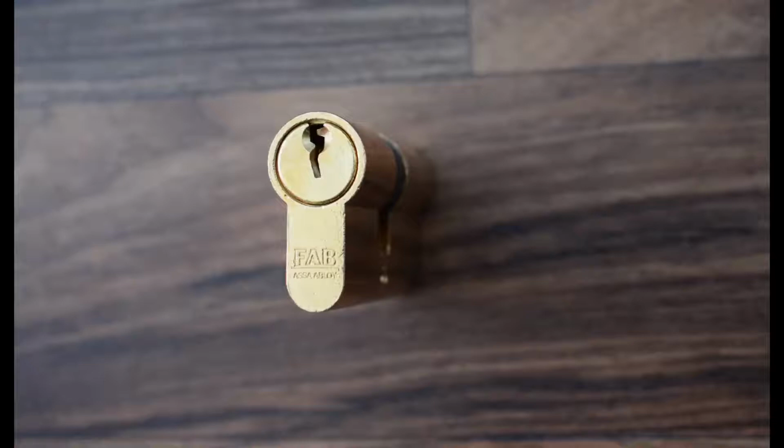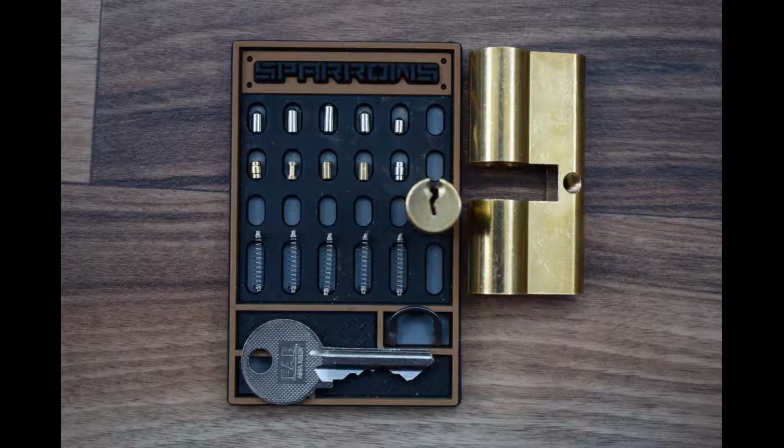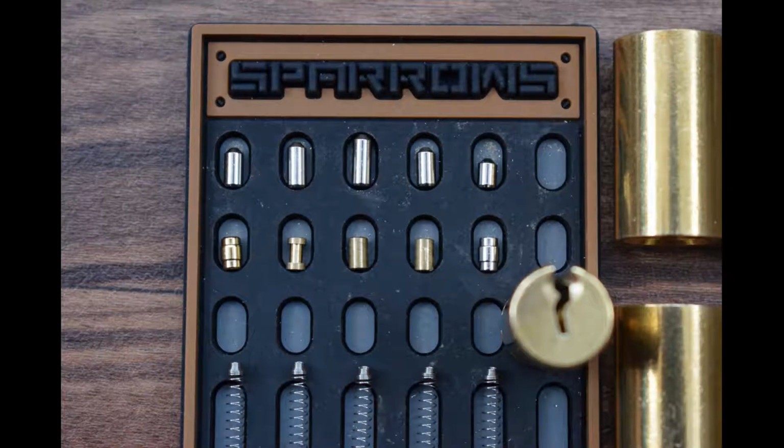This is FAB 100D. It's an older model belonging to the FAB 100 product line. It features the usual key without the RS nose cutout. This lock contains 2 RBC pins, 2 standard drivers and a single spool, which is the configuration that is now common in higher security locks starting with FAB 200. On the other hand, the keyway is now used in FAB 50 line.